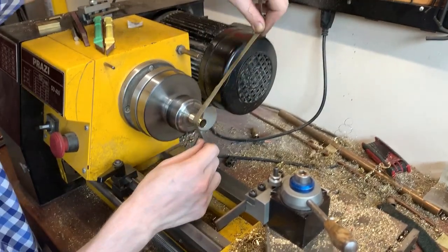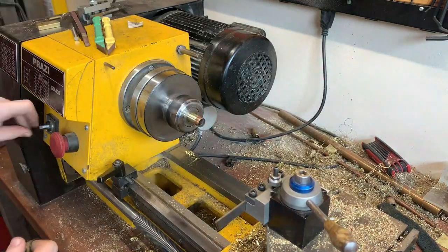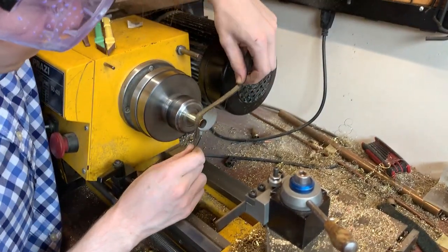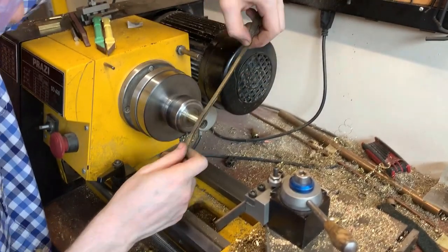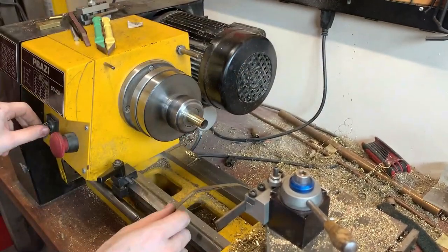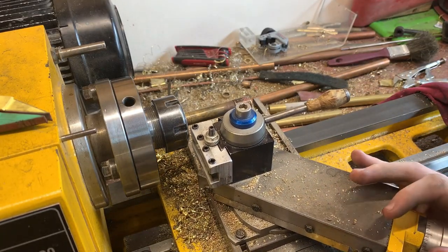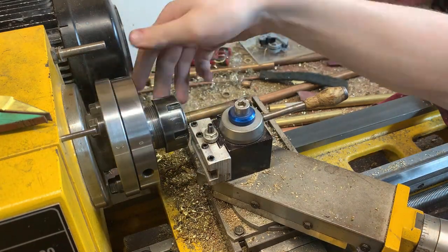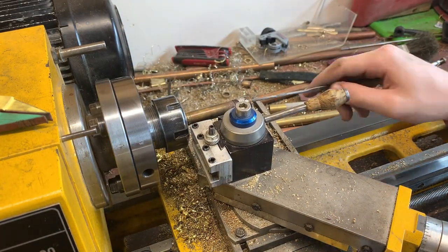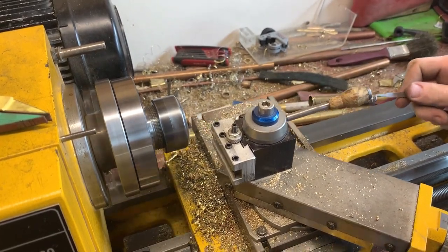The trouble with using a stencil instrument as a template was that we were working with a finite supply of tubing — it wasn't just brass stock tubing we could cut to whatever length we liked. We had to get all the valve slide measurements right first so we would still have enough tubing preserved for the rest of the instrument, with some variability in how we'd put the rest of it together, and so the whole process was a little bit stressful. Designing a custom trumpet is never the easiest process, but it was definitely a lot of fun, and I think cutting the tubes was my favorite and most satisfying part of the project.